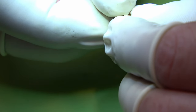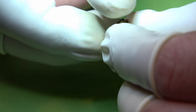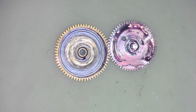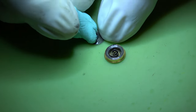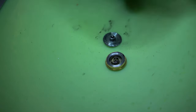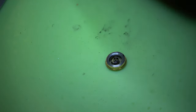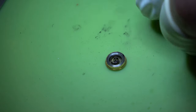And then with those clean, we can look to remove the springs from the barrels. Now these are those arbors that are attached to the lid. I've come across this sort of thing a few times. But you can see how much oil is in there. We're going to use a bit of Rodico, clean it up. I mean, look at the state of that. It's making a right mess of me mat. But still, before it goes back in any of the trays, I will clean them up as best I can.